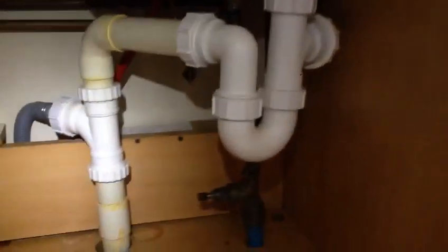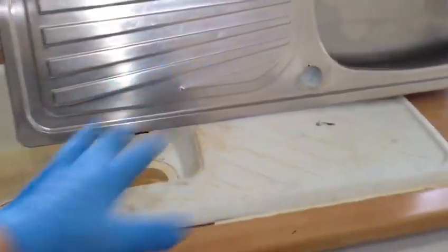So as I said, isolate the water first — make sure the water is off. That was just for the cold water; you must also find the isolator and isolate the hot water too. Once both hot and cold water are isolated, you start removing all the drain pipes. In the next video clip I'll show that. As this new sink is larger than the old one, we must cut the worktop a little bit to adjust it.